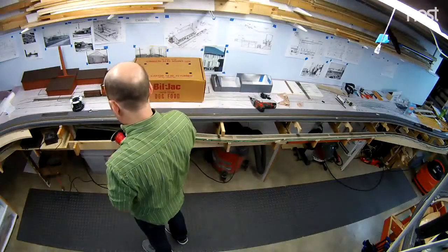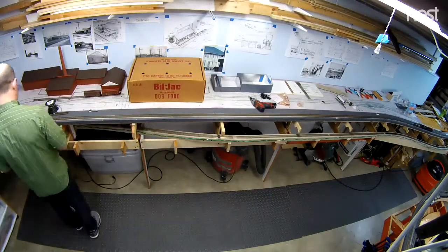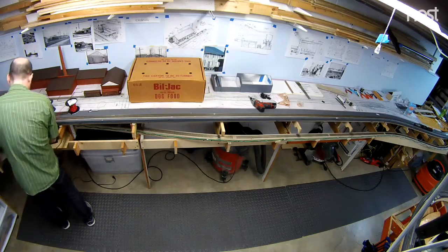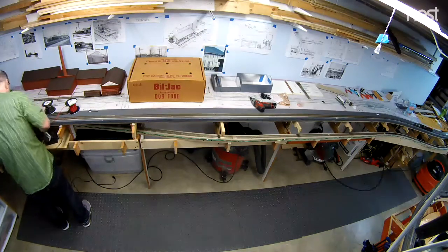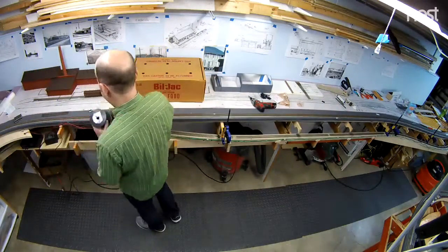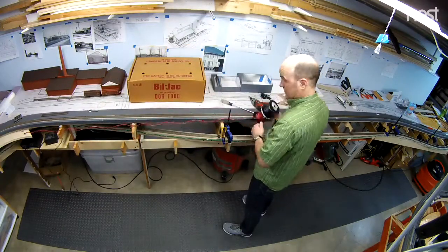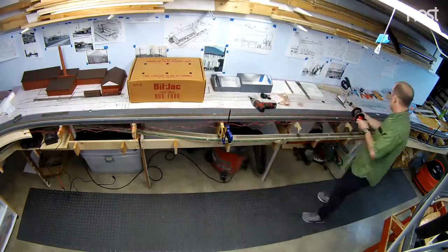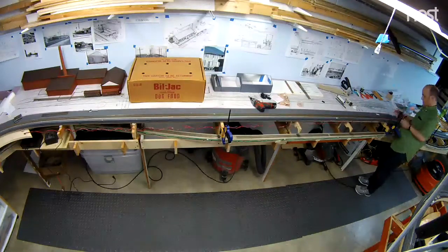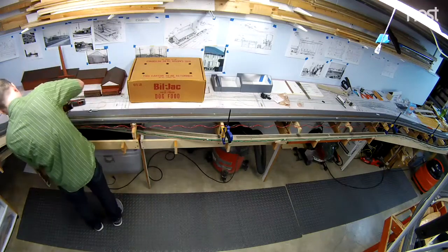Once that was good, I moved down to the bus wiring on the Circleville side of the basement. This is going to be the red and black circuit, which powers all of Circleville. The first thing I do is just anchor it to one of the joists so I can pull and twist them. These are on spools you get at Home Depot or Lowe's — I put the two spools on a long Phillips head screwdriver and twisted them as I went. That worked pretty well. Because they're on a fairly small diameter spool they're kind of tightly wound, so they retained a pigtail look, which didn't turn out to be too much of a problem. That left some slack and it came in handy later.